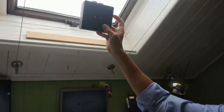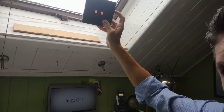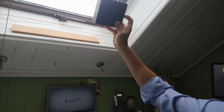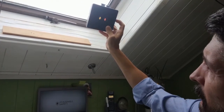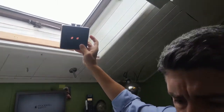I think the match is 7.4, which would be within range for a pool sample. It's now been two minutes on the total chlorine, so let's look at that. Using the same color wheel as with the DPD1, the match I get is 2.5 — going through 0.5, 1, 1.5, 2, 2.5. That matches the free chlorine result.